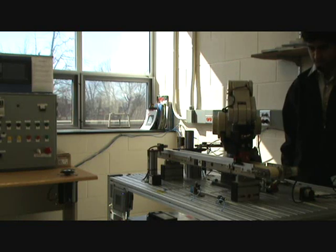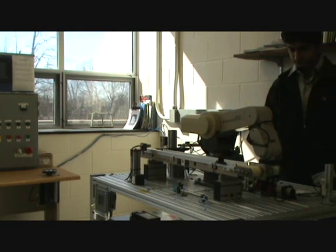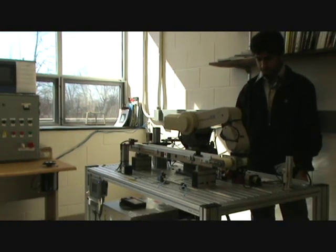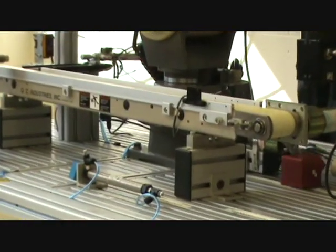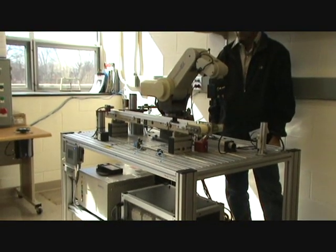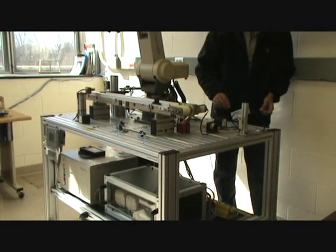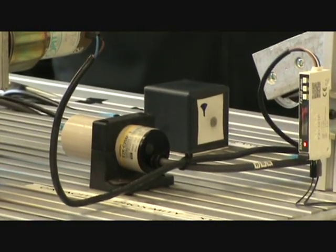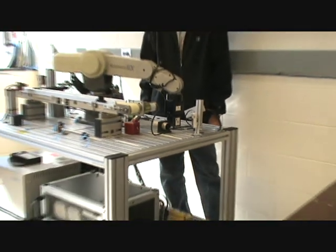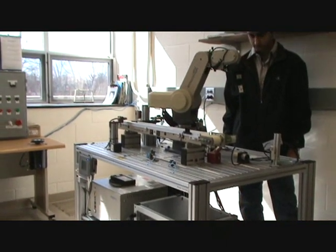The process is done and the robotic arm picks up the metal cube and brings it to the metal unloading area, then returns to the home position. The gear motor moves the part from the unloading area. Next, a good part marked as a circle arrives — the Cognex system recognizes it as a good part and the robotic arm picks it up and brings it to the loading area for processing.